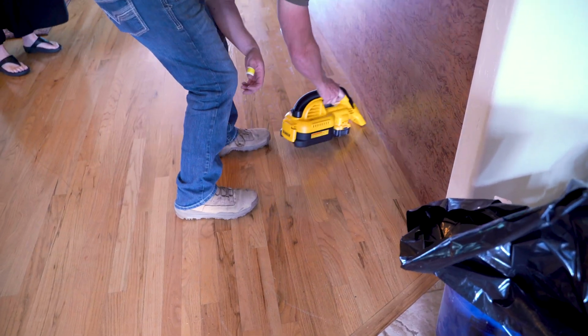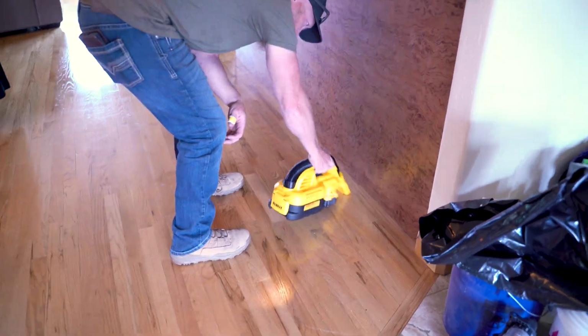One thing a lot of people want to do is mask first. I don't like a bunch of dust stuck to my masking because when epoxy drips off, it will disrupt stuff. And the plastic often has static electricity to it, which will really stick that dust. So make sure you do anything that's going to create dust first. Get that all vacuumed up, cleaned up, and then mask your job off. You'll have nice clean masking plastic.